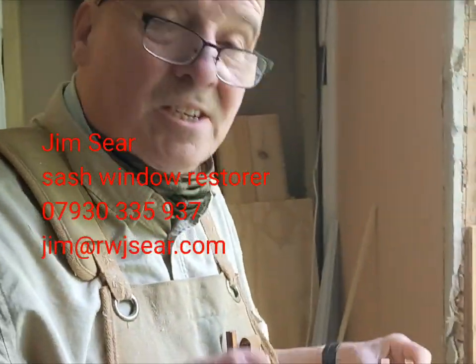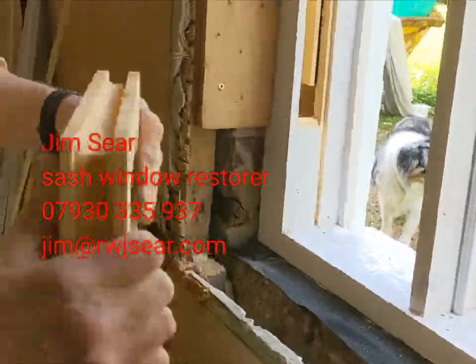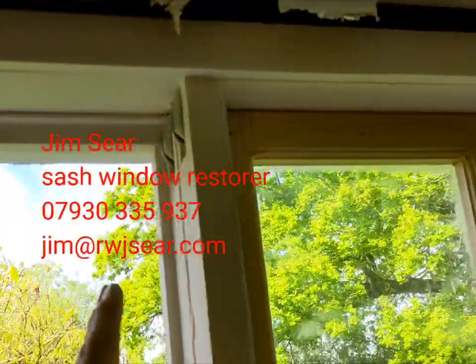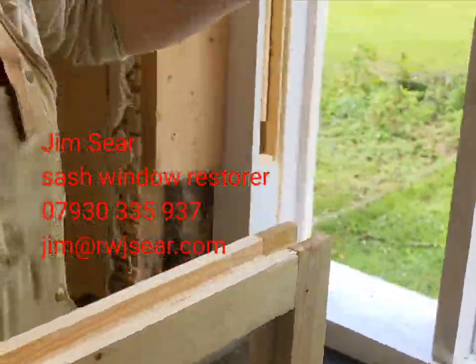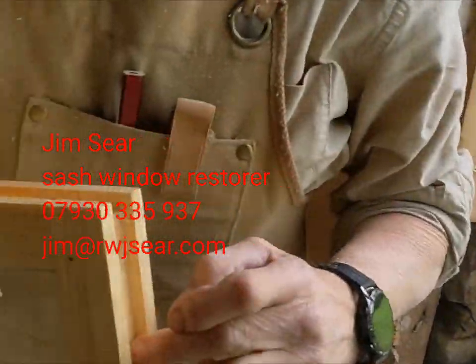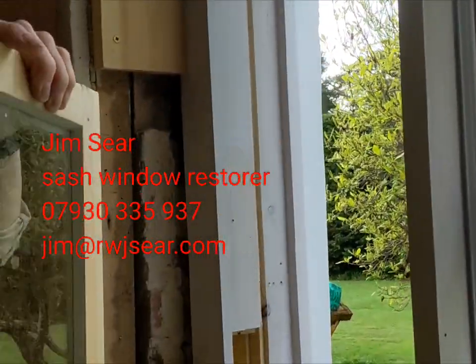Ready? Yep. Okay, right. To show you again, now here's the groove out of one side, and this is the top sash on the small side. If you look up there, you'll notice that the pulley housing comes out. So that there accommodates the back of the pulley. Across the top here, that accommodates the rope going backwards and forwards. And this one accommodates the sash pulley, the front of the pulley on this side. So we put that in.